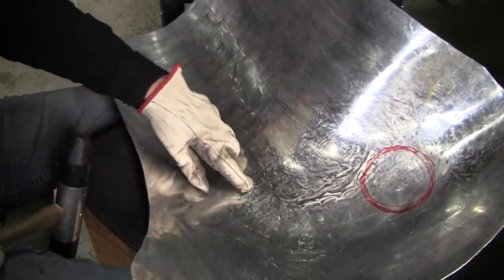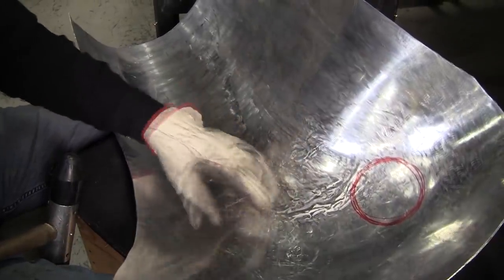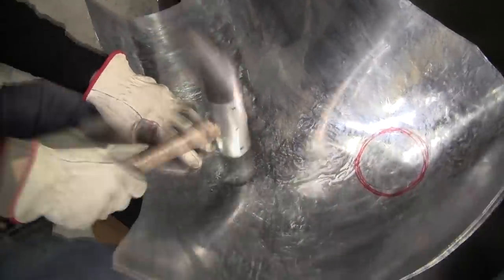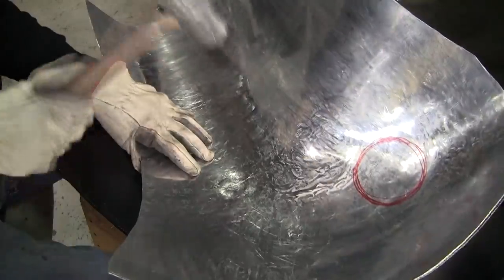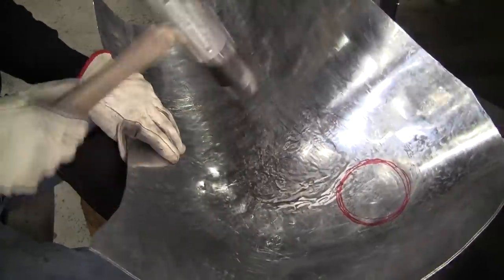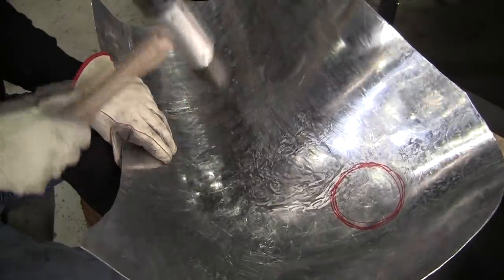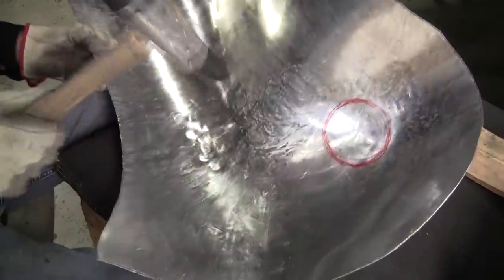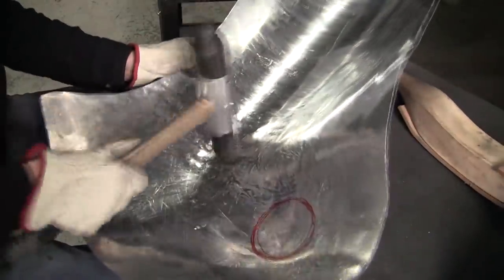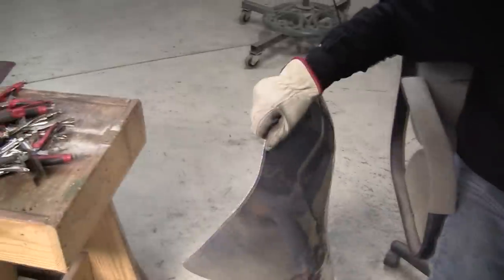Now, just because that's hitting the wire there, that doesn't mean you just hit that spot. You have to hit that spot down, but you blend it out, fade it in all around, so there's no what I call a mushroom head. Hit it harder there with more intensity, less hard and less intensity, and then you wheel it. So you do it a little at a time, one step towards your goal.